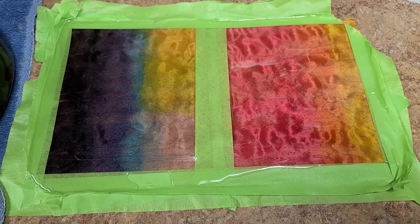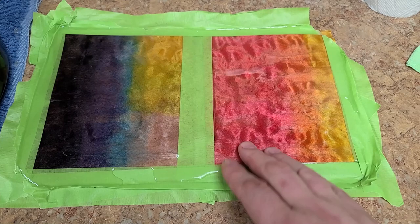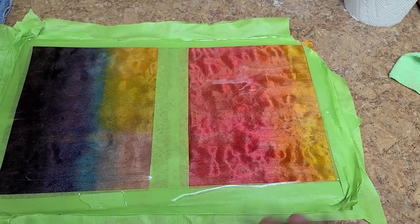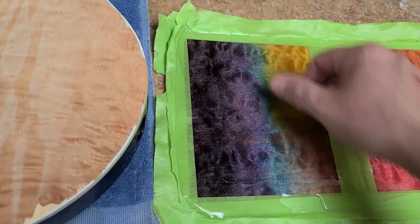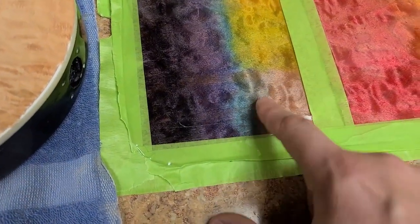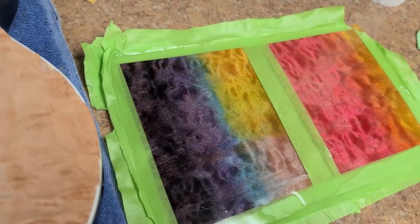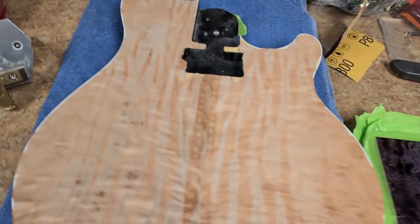You can see I've added some color to the veneer. I went with a pinkish side — I probably should have added a little more red — but you get the idea: red fades into orange, then fades into yellow, kind of like a flame type look. With some blues and greens it would end up having a flame or fire effect. On this side it's black, sanded back, with purple then blue added. Over here there's a bigger area of yellow, and right here a small natural area just to see what it looks like with no color at all. It looks pretty nice, and in the light it flip-flops and highlights the figuring of the wood — basically what flame maple does.